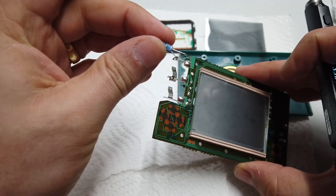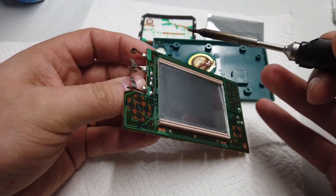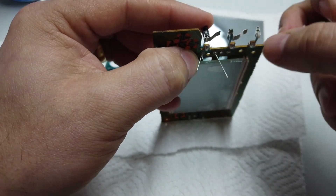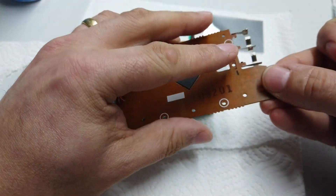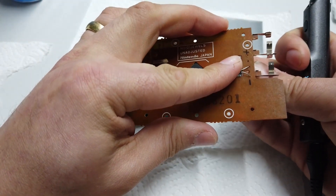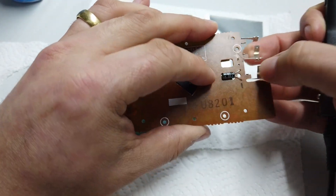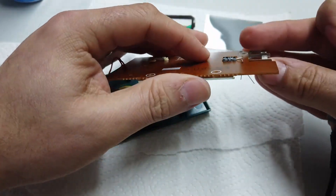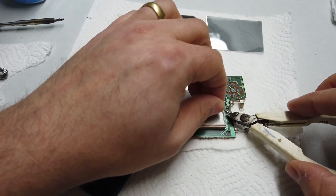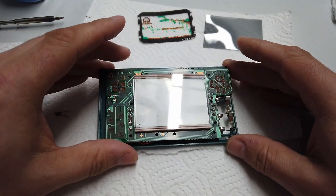Let's very carefully pop these two off the PCB. That's our 10 microfarad removed — I can smell old PCB! Let's open the hole up — lovely. All we've got to do is keep chivvying this along, and there we go — spot on. We've got that in the right way around. Remove the legs, and I think we're ready to reassemble and test.